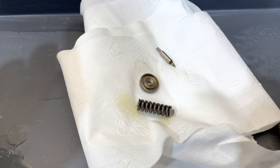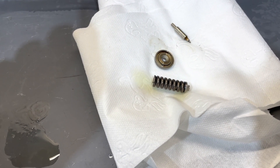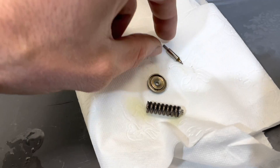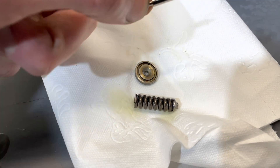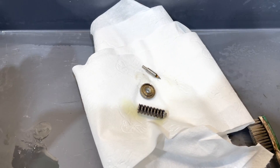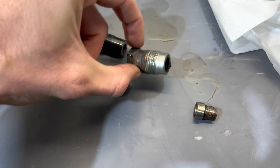I'm probably not going to scrub the internals with a brush at all. I'll give them a going over with the brake cleaner just to remove any residue or dirt, then wipe them with tissue. As for the nozzle body, I'm going to scrub that with the brush.